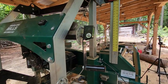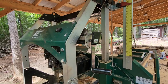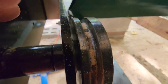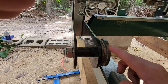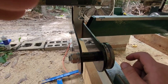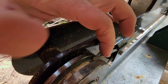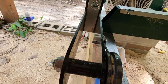That makes milling a little bit faster. It seems like about a quarter of an inch per full turn of that handle is what you get in drop. But keep your wheels clean — keep the debris out of these wheels. If you get too much buildup in there, it can actually raise your sawmill up by the thickness of however much debris you've got in that little channel. This mill comes standard with little wires that ride in those grooves to keep them clean — they're just out of adjustment. I need to loosen that bolt and readjust them so they'll lay down in there tight like they're supposed to, which will keep those wheels clean.